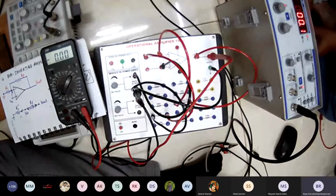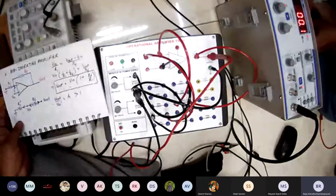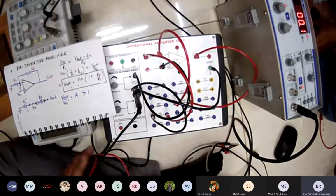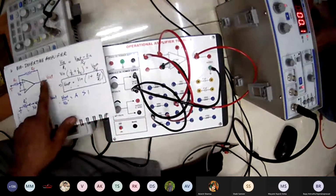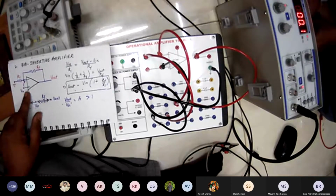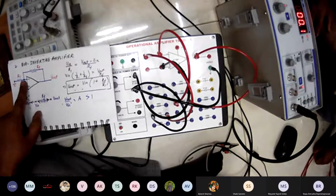I want to ask, in the paper that you have written, the non-inverting amplifier. As it is a non-inverting amplifier, sir, why are we taking that RF on inverting? No, that is how the circuit is made, because the feedback should be to the negative pin. The feedback of the output should always be connected to the inverting pin and not to the non-inverting pin, otherwise it would become unstable. The output would become unstable and you would go completely out of hand.